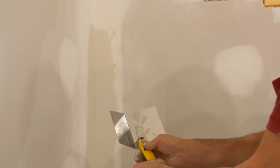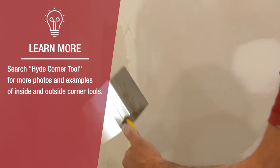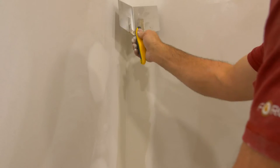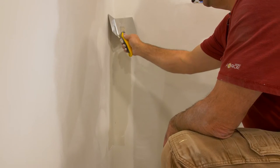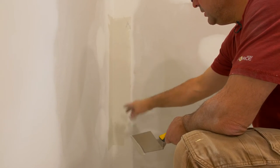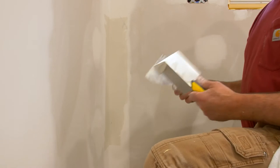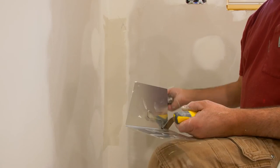This finishing tool allows you to smooth out both sides and the very corner with one pass, one tool. You'll want to start at the top, work your way down, and then start at the bottom and work your way back up. The groove created by the six-inch knife gets filled in and the edges are feathered simultaneously. Then you can clean that up with your six-inch knife on the outside, and it'll be ready to finish, sand, and paint — both sides done in one day.